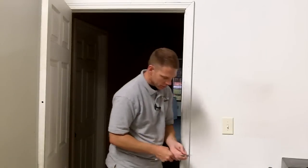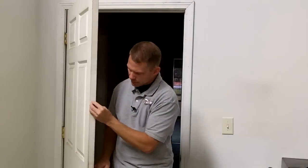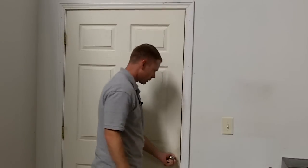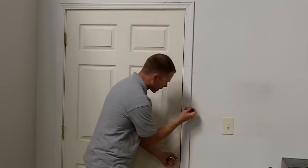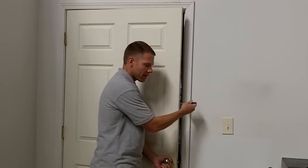Once you get that installed, you're going to have to put the magnet in the door side. The magnet takes a three-eighths inch regular drill bit. When you drill that three-eighths hole in this side of the door, that little magnet just inserts and you push it so it's nice and flush. When you close the door, that's going to be lined up with that contact. What I like to do is put the contact side in first, then take my screwdriver while I'm looking in there and line it up to put a little mark on the door where that magnet needs to be.